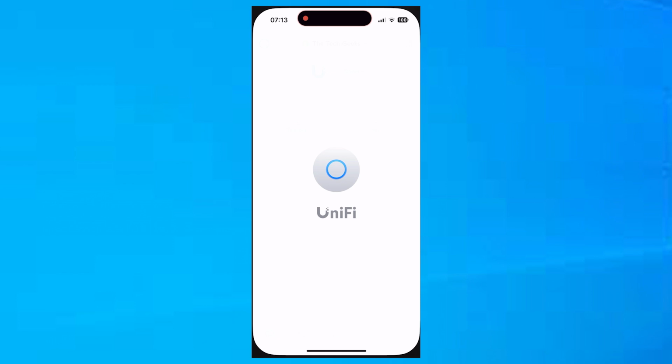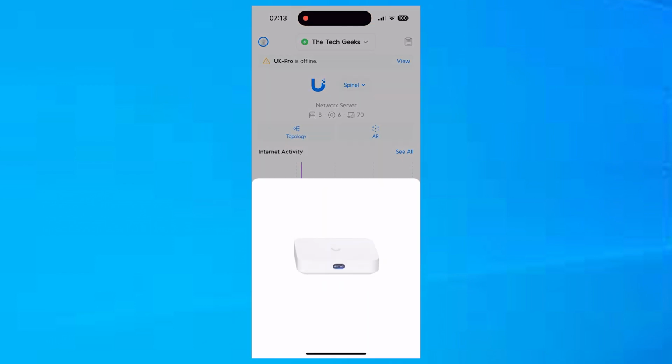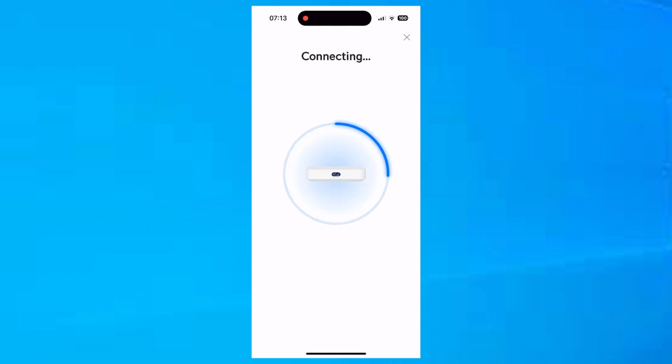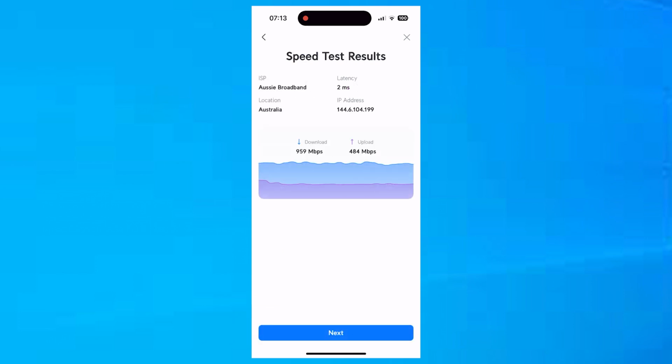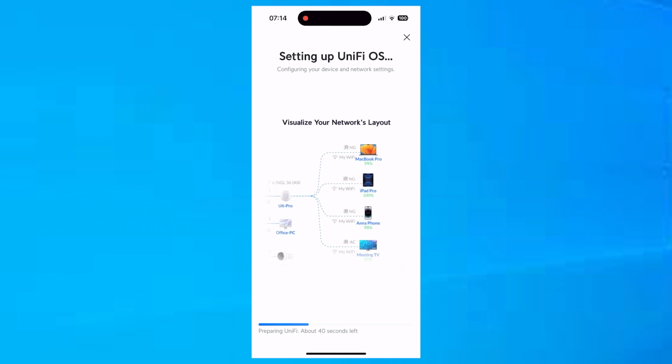The first time you power it up and you start up that UniFi app, you'll get this showing on the screen. It says it's ready to adopt, and so we're just going to accept that. It's going to go through the pre-config. All this is really doing is adding it to your controller in the cloud. You can do this all locally, but most of this will work if you're going to connect this to unifi.ui.com, because that is the location where you can have remote access to this. This is why I like to get this done now, because then I know it has connected to the internet.